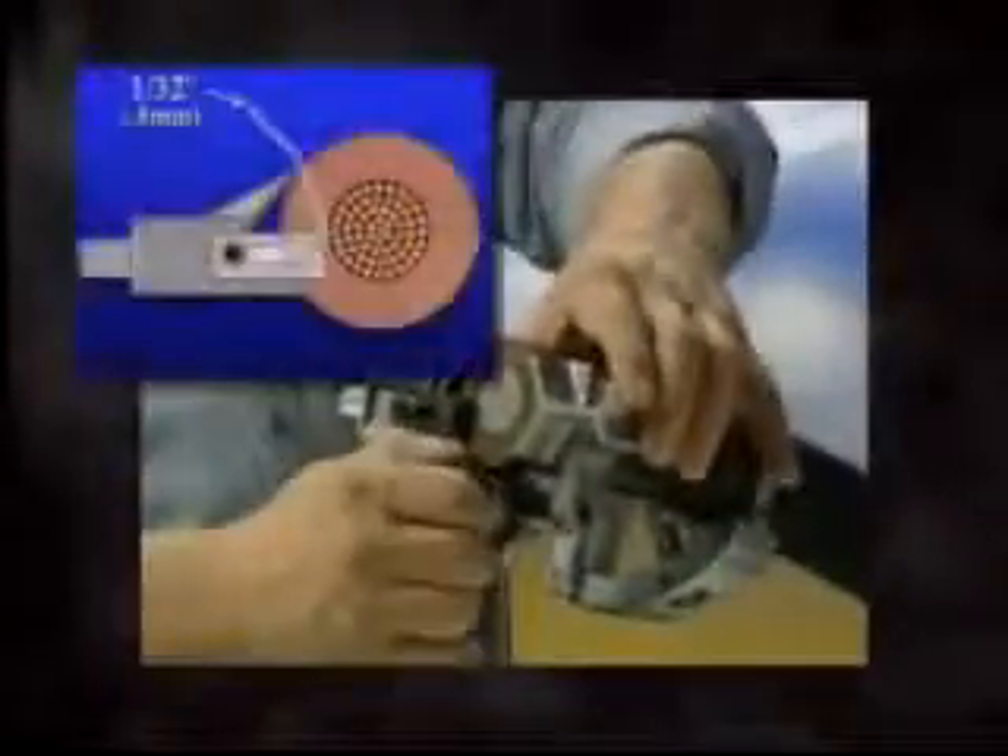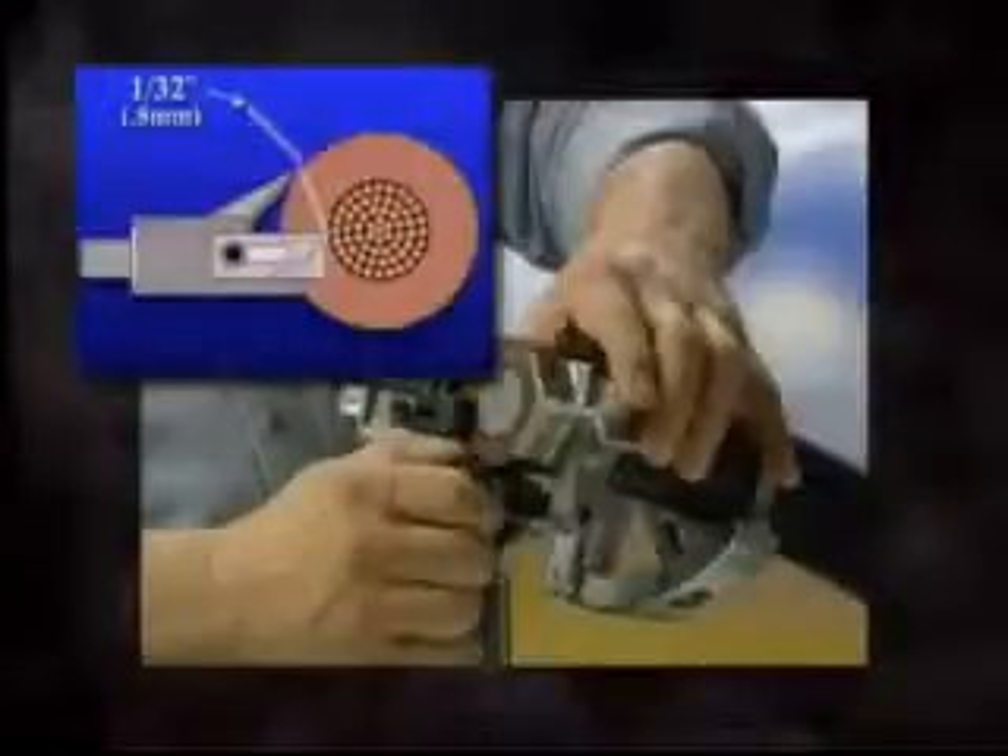Loosen the locking knob and remove the tool. As an added bonus, this tool will also end strip insulation from medium voltage cables in much the same manner as outer jackets. It is especially useful for softer EPR insulation removal on large conductor sizes. It is recommended to leave the semi-con layer on when stripping EPR. Set the WS64U up in the same way, adjusting the blade to 1/32nd of an inch, 0.8 millimeters, above the conductor. Slowly feed the tool by applying a slight forward pressure to engage the blade, and continue stripping until the proper length of insulation is removed. End stripping of secondary voltage outer jackets or spacer cable is performed in the same manner.